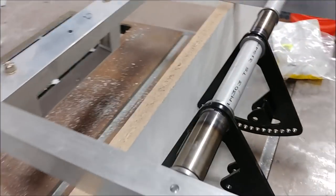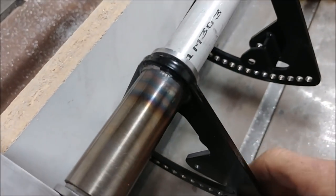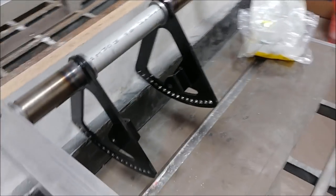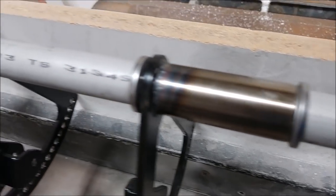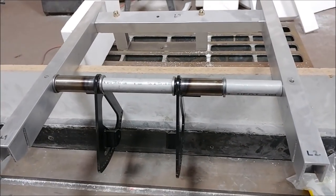Here I've just mocked up what the first set of rudder pedals looks like. I've got the quadrants in there, pressed the oil bushings into place, and got the little spacers in there riding on the rods — so that's kind of how it's going to work. Still waiting on the actual legs for that; Brit still has that on his list of stuff to do for welding up.